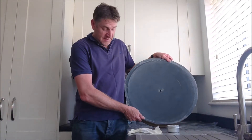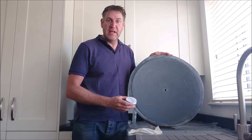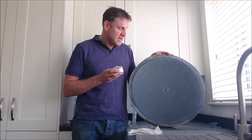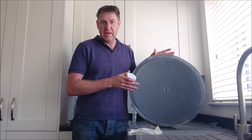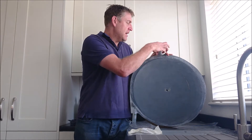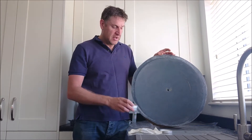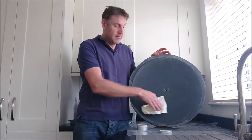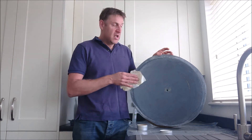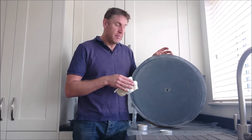Morning — so it's another day. I've left this Easy Lease to dry overnight and now it's ready for the next stage of the process which is the wax. So again, this is a release agent used to stop the carbon fibre sticking in the mould and make it come out nice and easy without leaving any surface problems. It's a bit like shoe polish — it's kind of a hard wax and I use it much the same way. So I'm going to use a cloth to apply some in small circular motions to cover the entire mould, then wait 15 minutes, lightly polish it, and repeat that process three times.